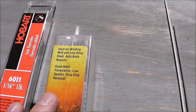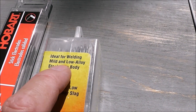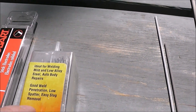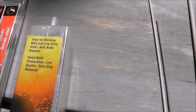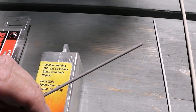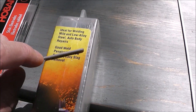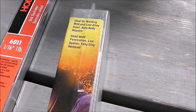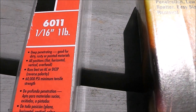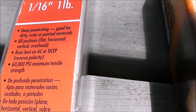Now in last week's video we talked about the ideal process — stick welding isn't ideal in my opinion for welding sheet metal, but look what they list this as: ideal for welding mild steel auto body repairs. So that's going to be thin metal if you're using 1/16-inch rods. Good weld penetration, low spatter, easy slag removal. 6013 has what's called high deposition, meaning it has a lot of coating on the end of the rod. They tend to burn really fast and leave a lot of material that goes down quick, which is better for a poor fit-up. As opposed to 6011 rod — deep penetrating, good for metal that is dirty or rusty — and it says right there it runs best on AC or DC electrode positive, which is reverse polarity.